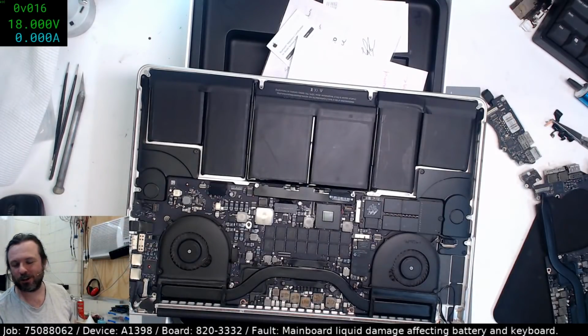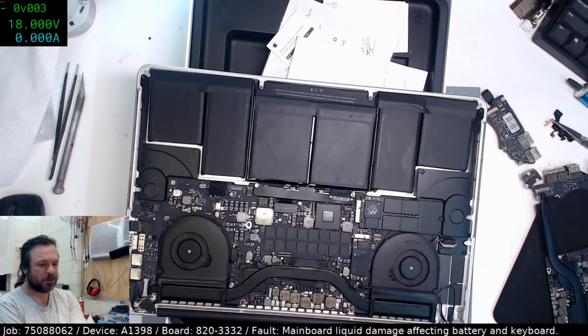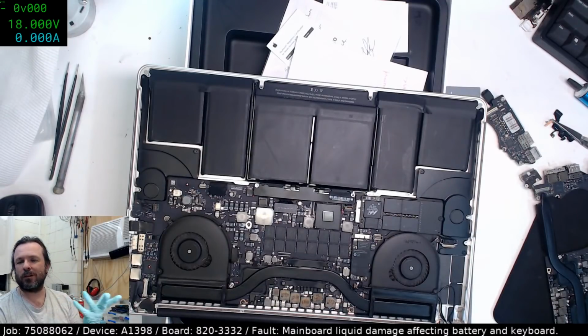I don't know if you needed that information or not, but I thought I'd just explain it overall to everybody. It just makes it easy to describe the type of battery pack you're dealing with and say, well, it's safe to charge at 1C rate, or 2C rate. But when they get below a certain threshold, you've got to drop back to 1/10 of a C. If you look at the manufacturer's data sheets on lithium packs, it usually lists it in there somewhere.